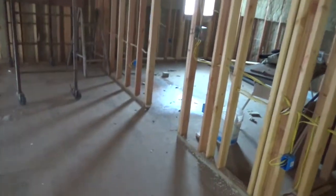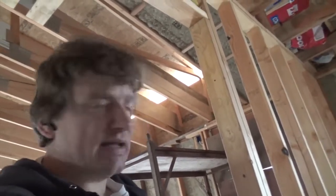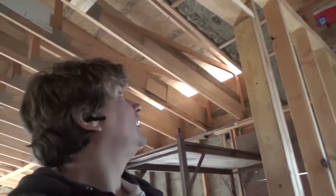I also went up on top, and at this point I'm never going to guarantee I fixed any of the leaks, but it looks like I must have pivoted my boot on top of a particularly vulnerable piece of the Zip System tape. Anyways, there was a dime size hole that had been torn in it, and it was in the wrong spot where the water was going down and collecting against a ridge line of tape and funneling it. So I couldn't figure out why that's a hell of a lot bigger leak than we've had in months. But now it all makes sense to me. So I believe I've got her fixed.